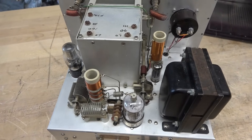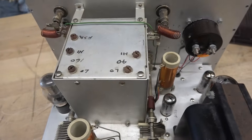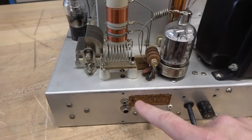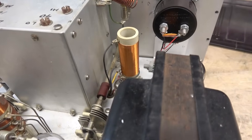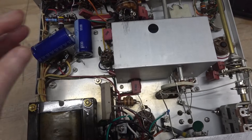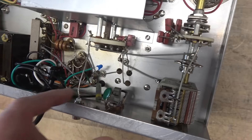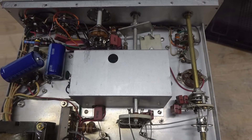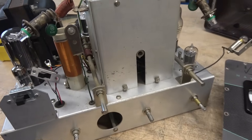The Navigator is a very rare and collectible radio — CW mode only, puts out about 25 watts, runs a single 6146 output tube. Modification-wise, somebody has added a little 1/8-inch jack which we'll investigate. The bottom side of the chassis looks pretty good, nice and clean — somebody has replaced the main filter caps. Most important right now is to ensure it is safe to turn on: nothing loose, everything looks good.